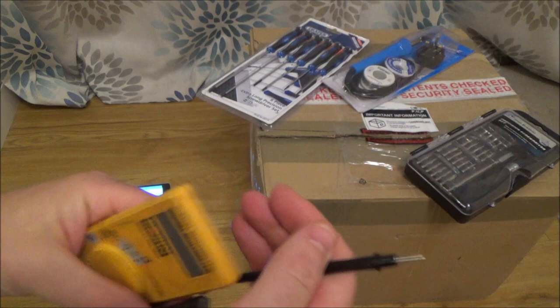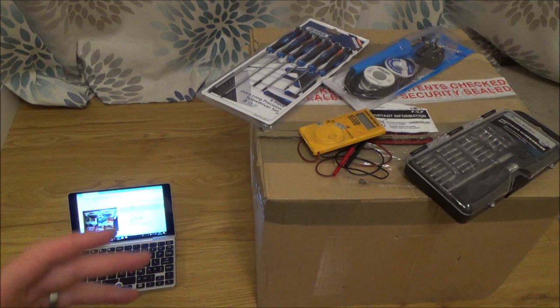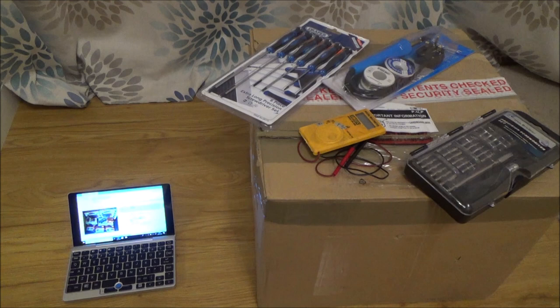Although I'm going to be working on games consoles and controllers in this video, the same thing applies to anything, whether you're trying to fix your car, your washing machine, your cooker, whatever is faulty, by using simple fault finding techniques, which is just common sense. If something's not working, is power getting to it? Is the fuse okay in the plug? Is the power you're plugging it into okay? Is there any power coming through that adapter if it's converting to DC voltage? Then you can work through, power's getting to there, and move on to the next step.